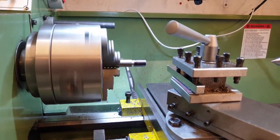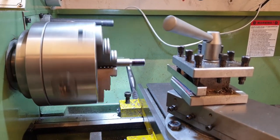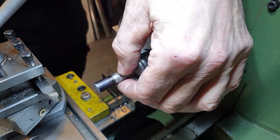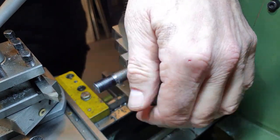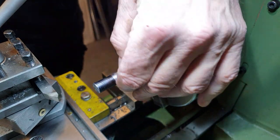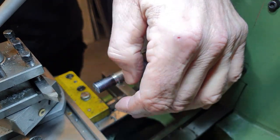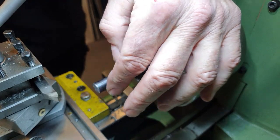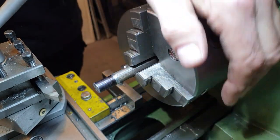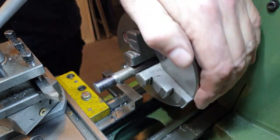And as we can hear, the gear is quite noisy. I've got a bit of a half-inch bar in the chuck and I've turned that down to 12 millimetres. I've used the parting-off tool to cut a little slot for the tool to run out on, and I've applied some marker pen so I can see on my first scrap cut how it's going to look.